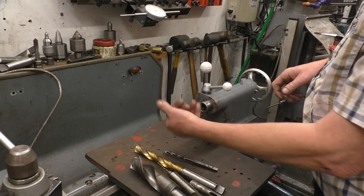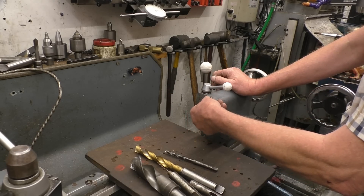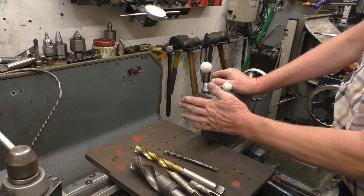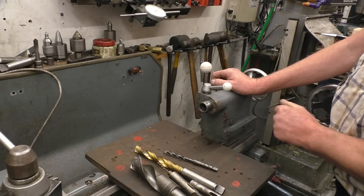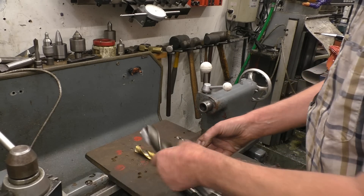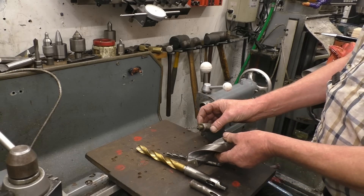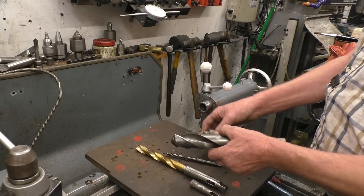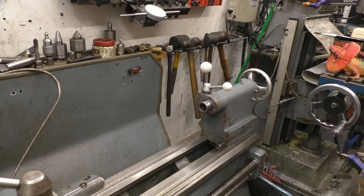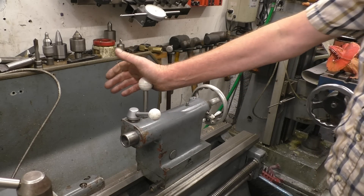It's important you take care of this in here — you don't want to allow the drills to spin, you've got to keep it clean. Some people actually put a cork in there to keep any dirt out, but it's important that you keep it clean. So you can basically go from that size to that size — I think that's 16th of an inch to inch and a half. The tailstock moves up the ways like that and can be locked off with that lever.